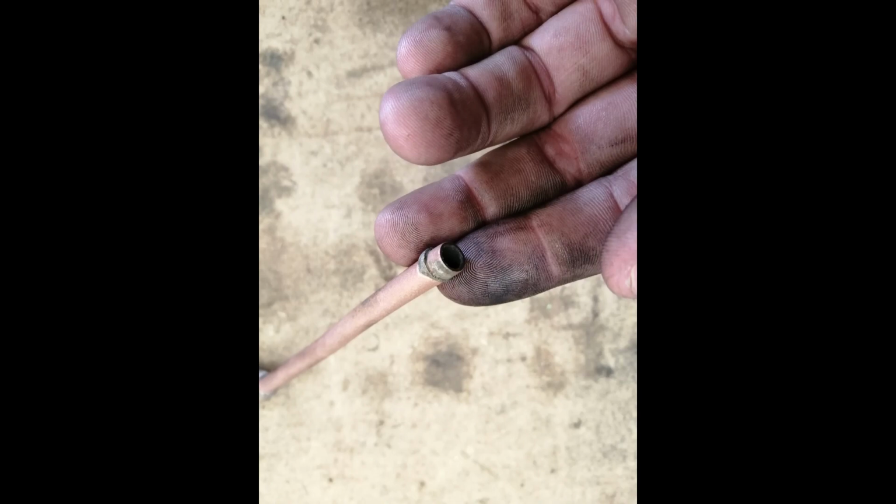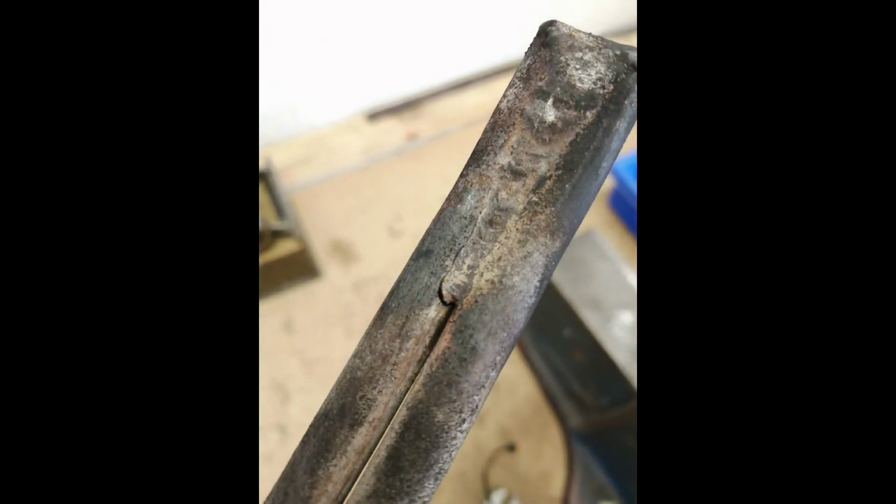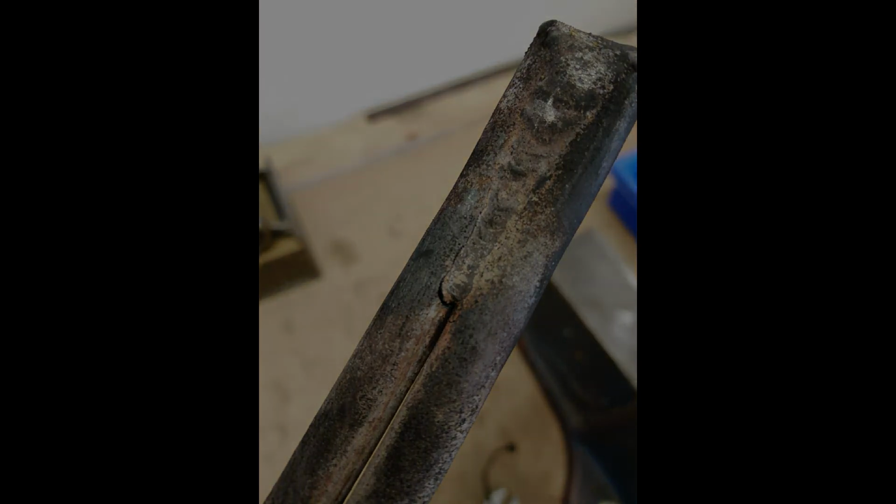So what happened when I fired up the loco? Well, a big amount of pressurized steam came through the superheater and just blew it apart. And also in these pictures, we later found out that there were some cracks developing in the other end of the superheater, not the wet header, where it sits over the fire. The weld head basically failed and was also causing the pressure to drop, and it was putting out the fire. It was cooling the fire down, therefore not giving me any more pressure.